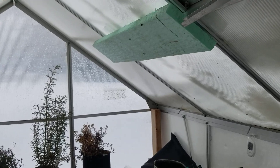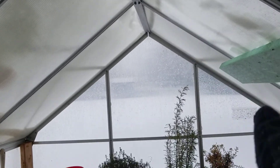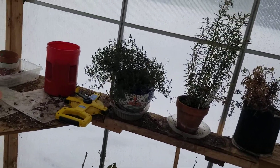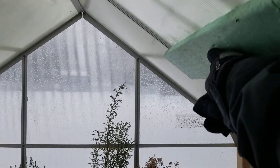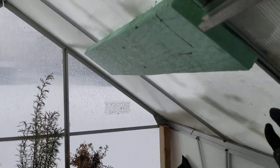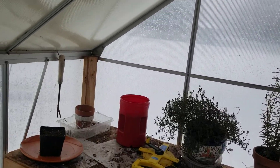I'm getting 35 degrees inside. The snow will actually help insulate it. These panels are still holding — the snow load is pretty heavy, probably about 100 pounds before I cleared it off. The corrugated panels are all still holding, vertical members still holding. I usually take a two by four and brace it here to keep this from sagging — you can already see it's got a pretty good sag in it, but a vertical member usually pops it back out.